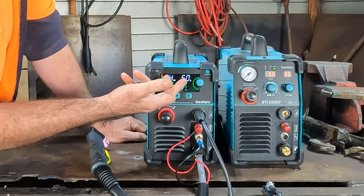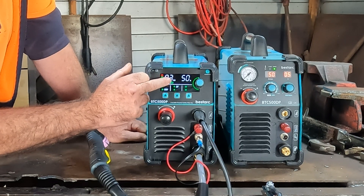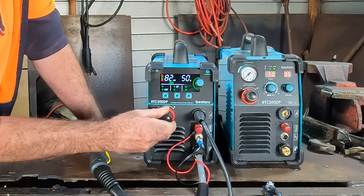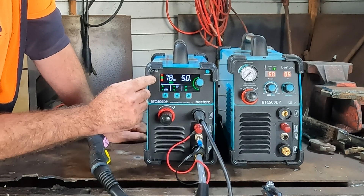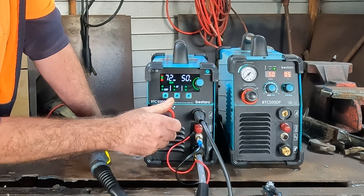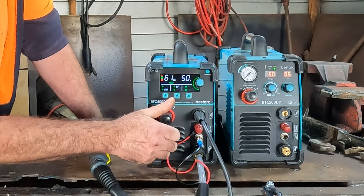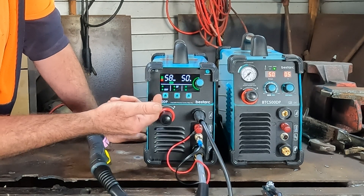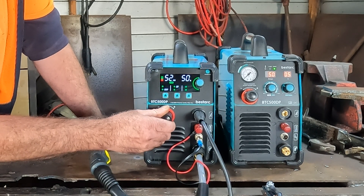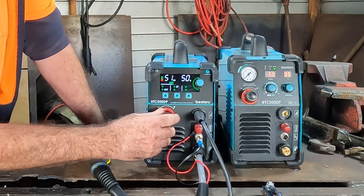Here we go - all the warning lights have gone out, changed to 50 amp on the amperage. The gauge is reading 82 PSI which is telling us is way too high. If we pull this out and turn it down, the theory is we should get three green lights telling us we're at the right pressure for the right amperage - cutting out all the guesswork. There you go, 59-60 PSI, the top two red marks went out so we've got green. About 60 PSI is where I normally run it anyway.